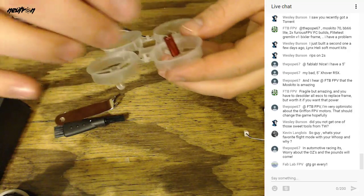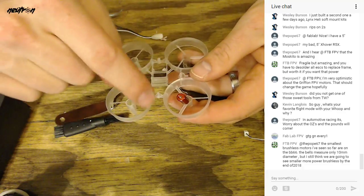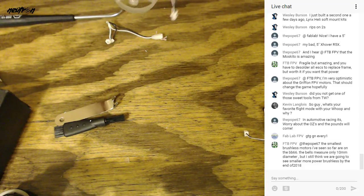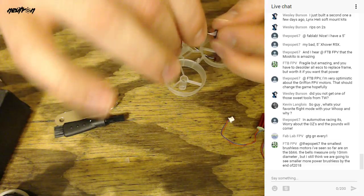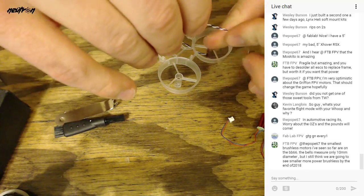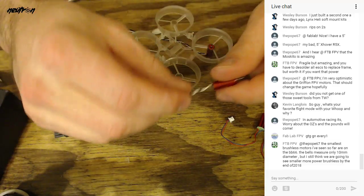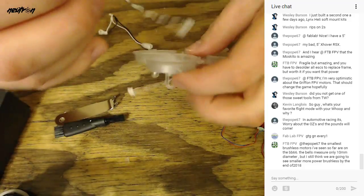Okay, so tiny boards, the Inductrix board, the motors spin outwards, spin away from the front of the cam. So our black and white motors are counterclockwise. I'm going to go ahead and place them in the correct spot. I do like to wind my motor wires. Looks like quite a bit of chatter going on in here. I like that. So wind those up. Be careful not to twist them too tight. I haven't done it yet, but it's very possible to twist it so hard that you pull out a wire. But be careful.